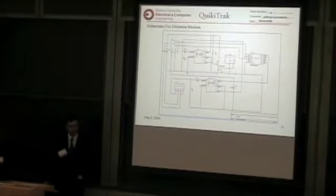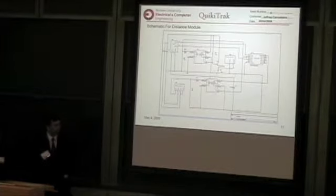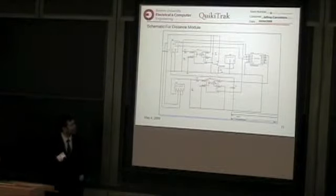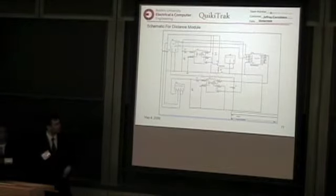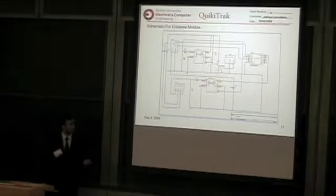We have an 11.1 volt power supply for the sensors, and we have a 5 volt power supply for the MSP430, which is the microcontroller that we're using. The optocoupler is over there, and that goes to the transistor, which is used to amplify the signal coming from the MSP430 in order to drive the emitter.